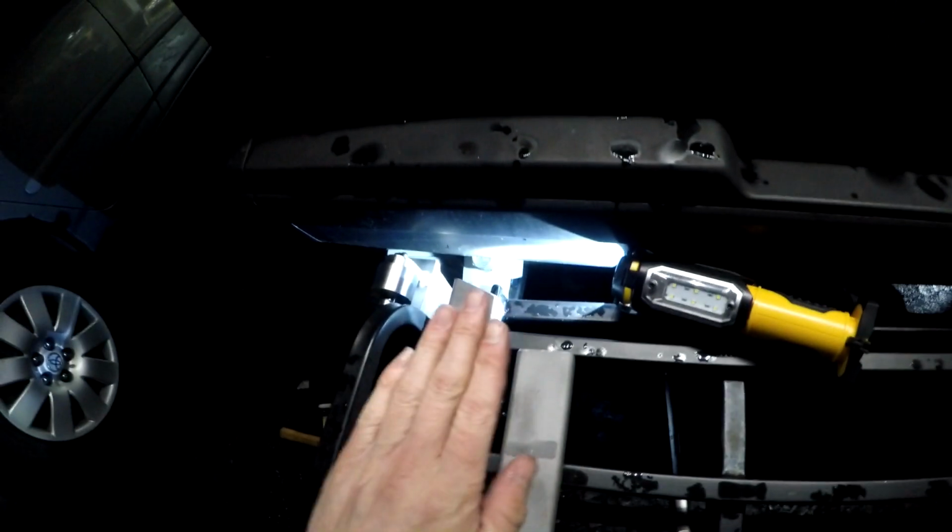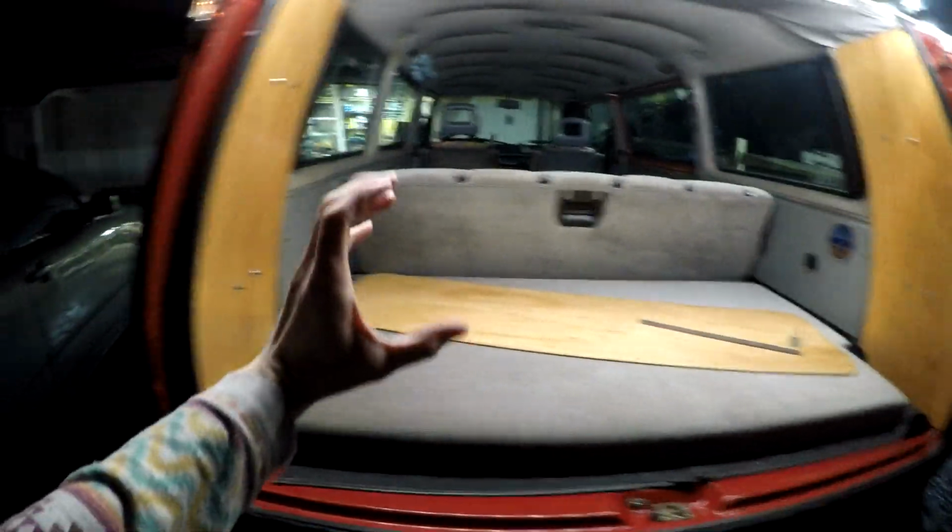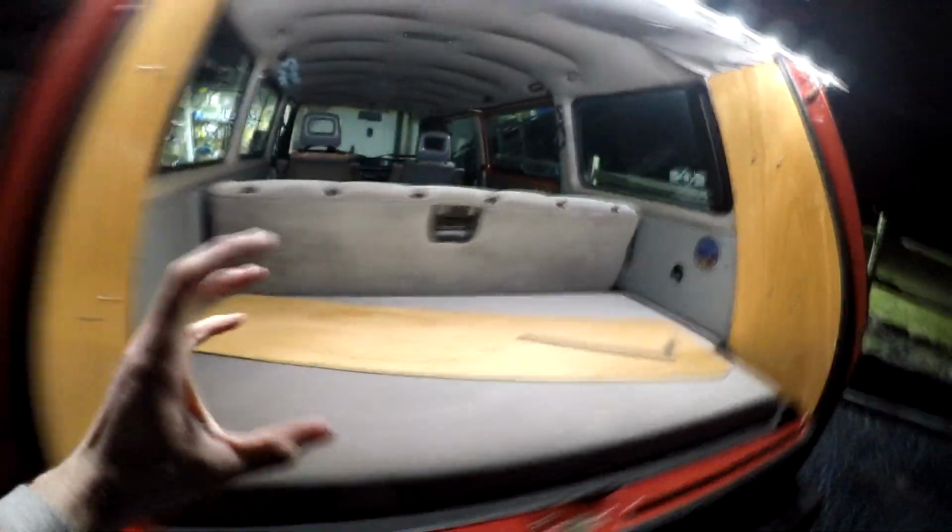Actually, I'm just gonna tack this together. I'm gonna put a little extension off of this, and it's gonna have the bolt pattern. I'm gonna get a ring that's the same diameter as the outside of the tire. I'm gonna just get a cardboard cutout, bolt that cardboard cutout on, and then I'm gonna pivot it out of the way. And I'm gonna make sure, 100%, that these pieces are long enough, because if it's right here and it doesn't clear, then I can just extend this and then it'll be farther out of the way and everything will be good.